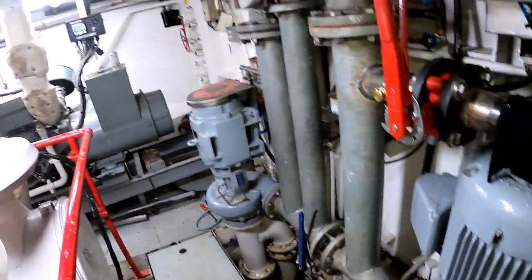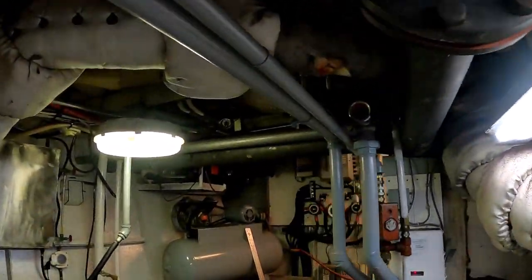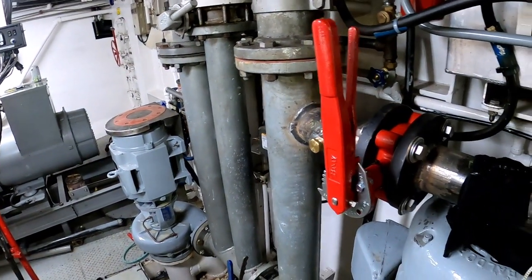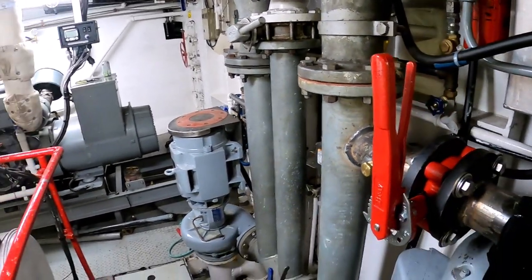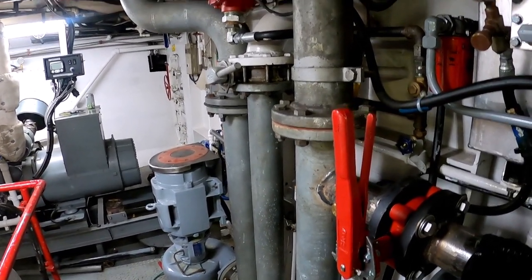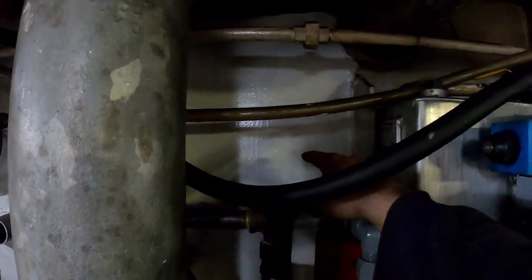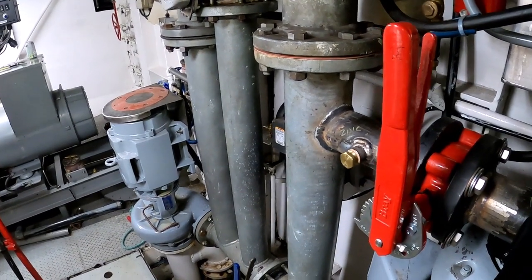These pipes, all of these pipes you can see, one going over that side, one going up top, are all part of the seawater circulation system. That's one component of a larger system called the RSW, or refrigerated seawater system. The point is to preserve our catch. Essentially, we add seawater to the fish hold, which is behind this bulkhead here. The hatches are actually frozen shut, otherwise I'd open it up for you. We put seawater into that fish hold.